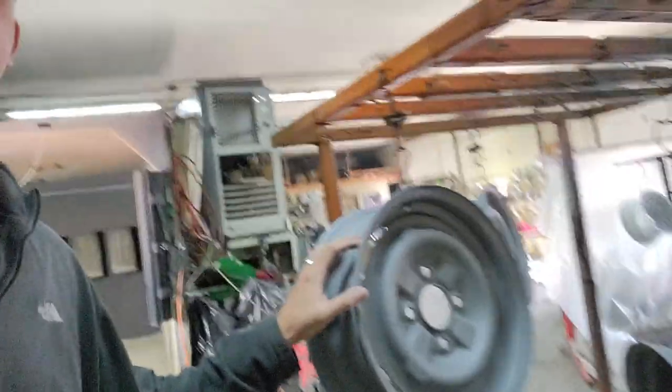Today we are going to be doing some steel wheels for you guys. I think we've done some of these in the past, but we had a guy ask us online about doing a zinc-rich primer, and these are the perfect application for that. What zinc does is it actually helps protect and seal the wheel or the steel part from corrosion. If there is any bit of rust on there, it actually helps to neutralize it so it doesn't keep growing and spreading.